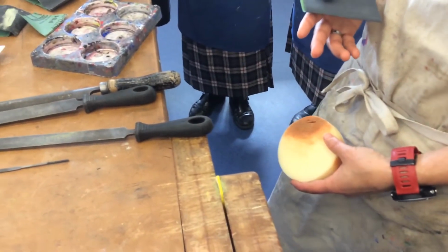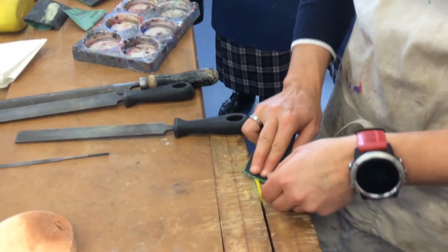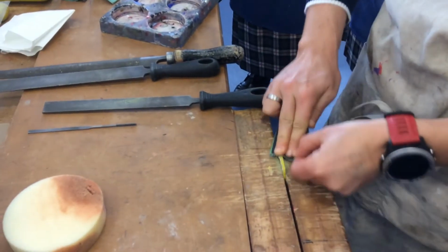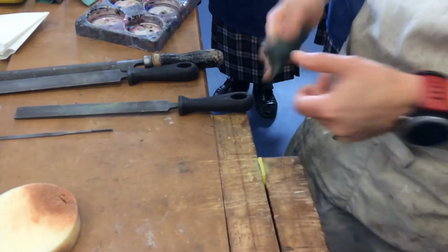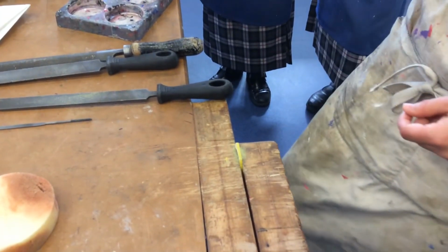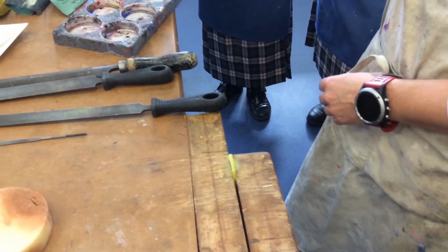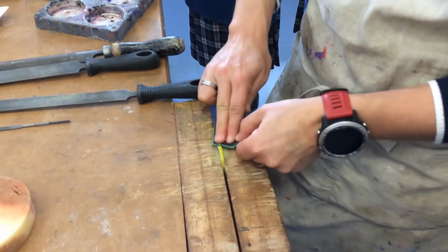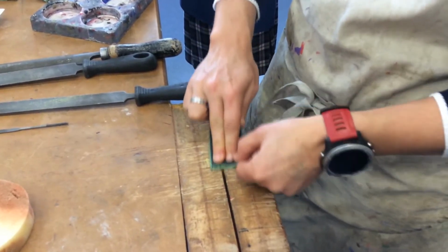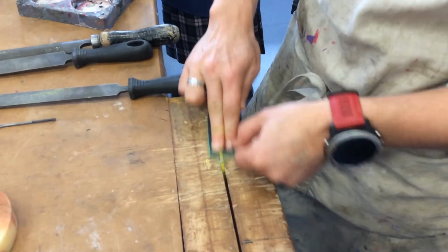It can't scratch itself. All right, and what it will do, if you gather a whole load of the dust and you keep on sanding over there like that, is polish itself if you turn it into a little paste with a bit of water. Now I've got acrylic dust on there, and I haven't wiped that off. I'm going to use it, and you will see in a minute that it turns itself to a fine, fine paste. And you're using the acrylic dust mixed with water, which is slightly abrasive, isn't it?